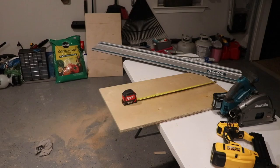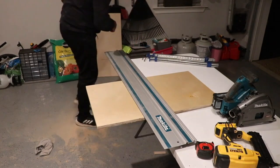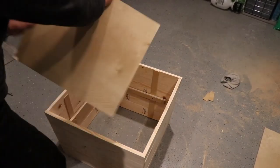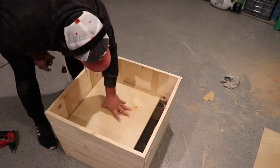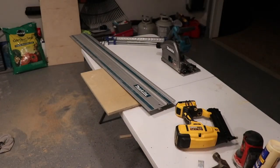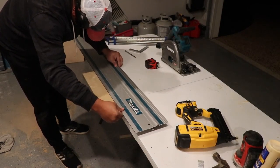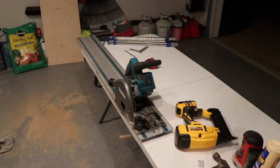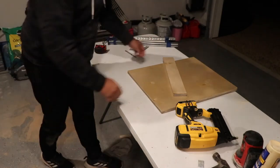I'm cutting that panel to go inside the box — I don't have any scrap wood that is long enough. I checked my box for square; it was right on the money, perfect. I just wanted to add in another strip of three-quarter-inch wood right there so it would meet the corner. I left one corner open because I wasn't going to cut another small block and glue it in there — it just wasn't necessary. Checking for square on that, I'll line up my one edge and glue it together.